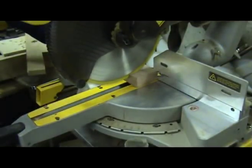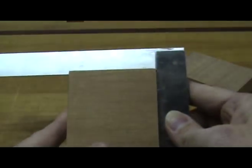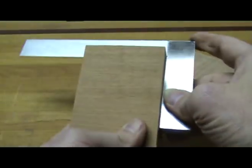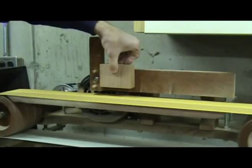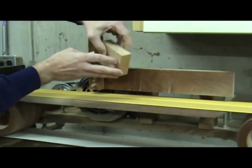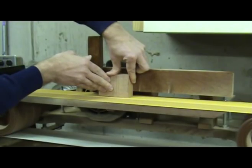This excess height allows for radiusing the top and back of the rims. Make sure the ends of the blocks are square as this facilitates glue up later. I like to run the edges across my sander so that I remove all saw marks and rough edges. Remember to keep everything square.